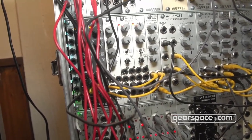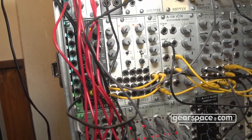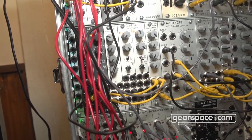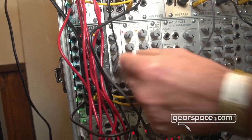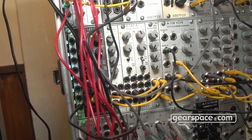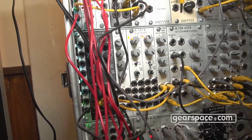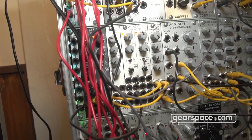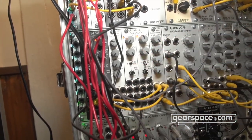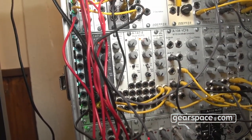So we find this a rather useful thing for a small system. You can decide if you need an auxiliary oscillator or an LFO. Another thing is that the modulation input can be switched off by this switch, or it can be used positive or inverted. And the control voltage input itself is bipolar, but if you use it as, for example, an audio oscillator, a lot of voltage sources like sequencers can't do negative voltages. Therefore, you can invert and then subtract. It might also be a good performance feature just to switch it off and on as you need.